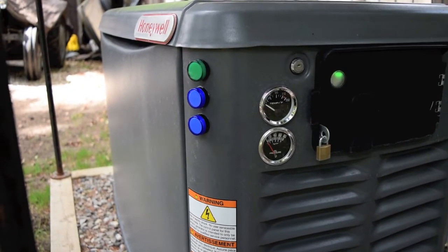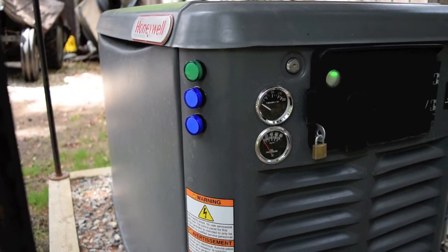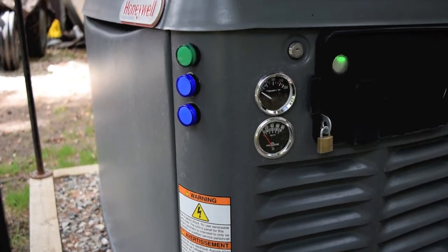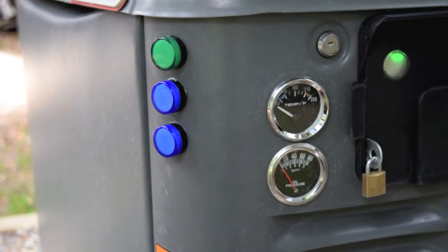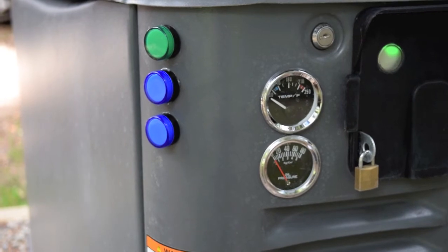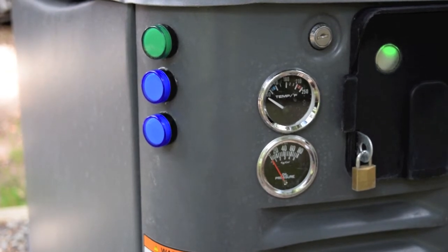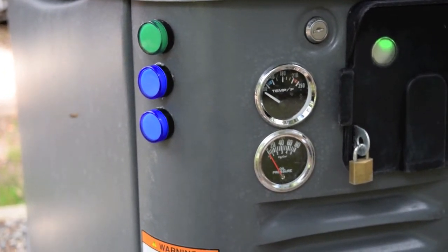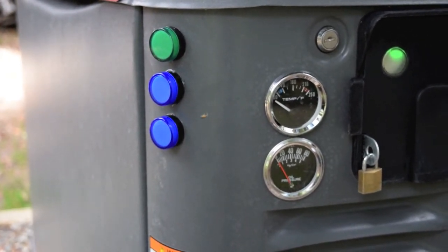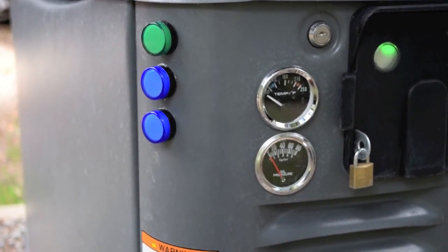Here we are at the end of the generator. As you can see, there are my two gauges — on top is oil temperature and on the bottom is oil pressure. When the engine starts and you get oil pressure, the green light comes on and the lower gauge will read the oil pressure. As oil temperature gets higher, the upper gauge will start reading. The middle blue light is controlled by the TC2 cube and the lower blue light is controlled by the TC1 cube.